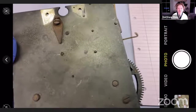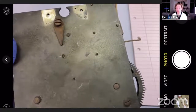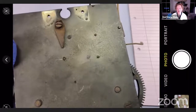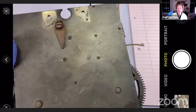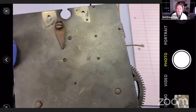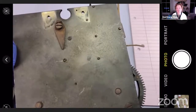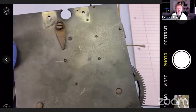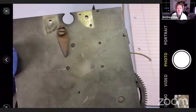What they are for is a complete mystery, frankly. But if you fill an oil sink with oil, is that the point? It just runs down the plate. Yes, admittedly, you can have a little bit of a reservoir of oil in there. But typically, the oil won't go around the corner anyway. So that wouldn't bother me here. What would bother me is if the bush is loose, it wasn't uprighted properly, and obviously we don't know what the condition of this pivot is.